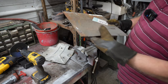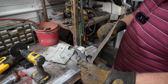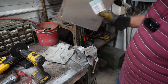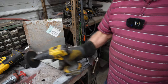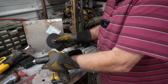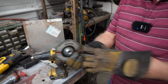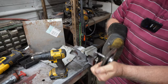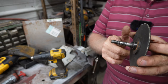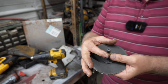Getting it set up — if it was on a fender or something like that. This is pretty heavy still, it's 22 gauge, but I don't think it's any heavier than what you would normally have. That cut just fine. Now another issue is this wants to slide in the chuck where it's chucked up. What I'm going to do is make three flat spots on this shaft.